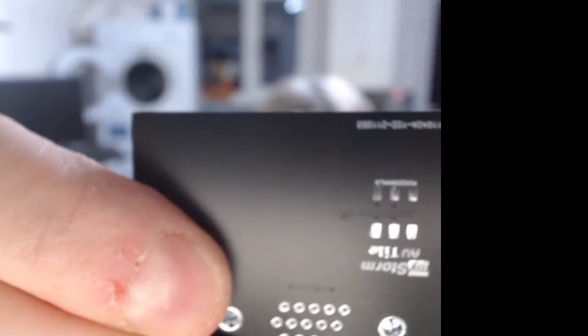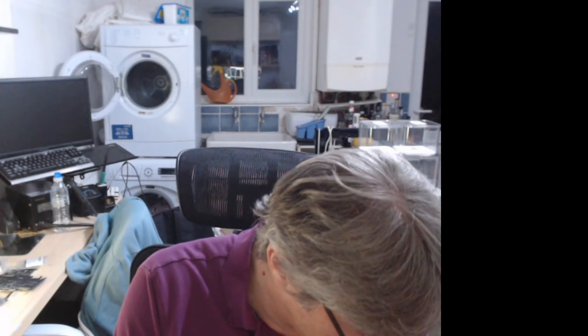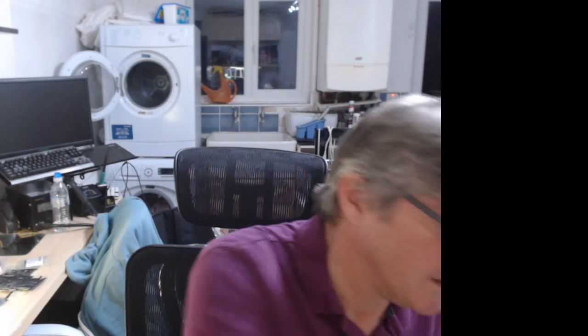You could put a 6-pin 0.1-inch surface mount header. So you've got things like the analog IOs, the mixed signal IOs on there and stuff, and the resets and things like that. And then finally, the bigger one of them. But again, this is still small compared to normal frame size stencils.